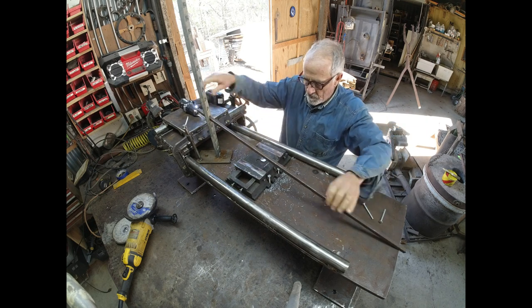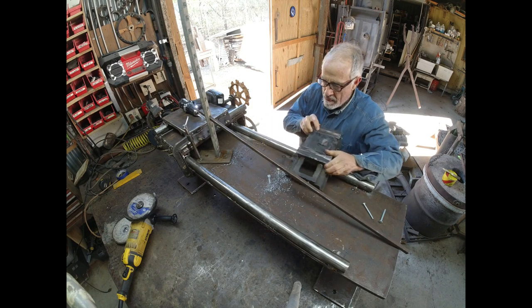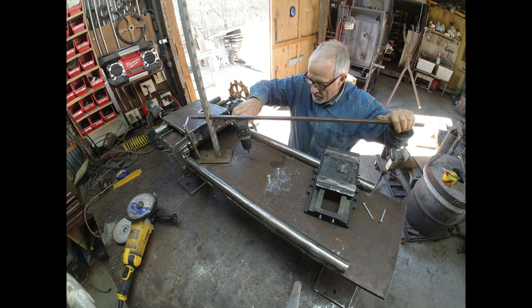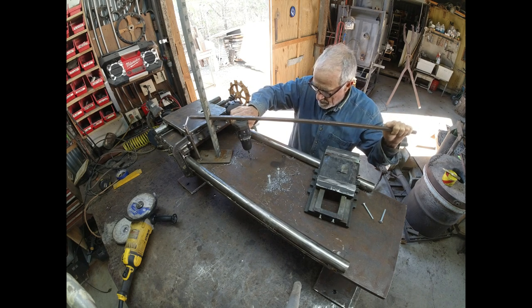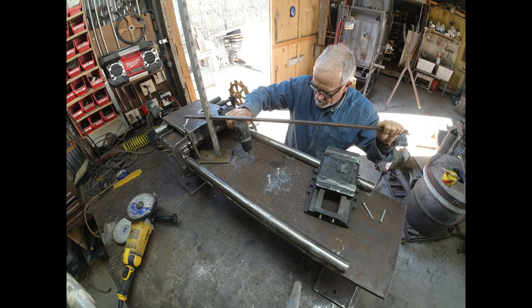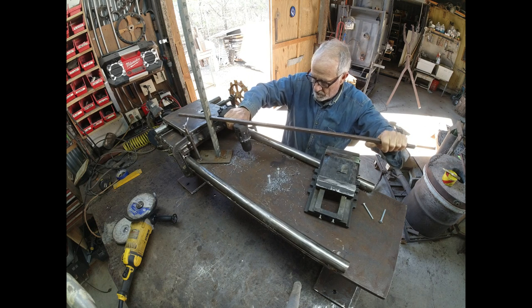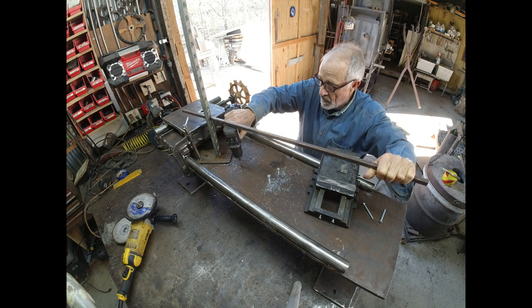Drill bits like a lot of pressure. They like a constant chip coming out. They dissipate their heat through the chip. And if you let the bit spin without a chip coming out, the heat builds up and your bit is toast usually. So you can't really push too hard, except on maybe little bitty twist bits. Sometimes they'll break if you push too hard. But most of them, they like a lot of pressure, and the holes go fast, and everybody's happy. The bits stay sharp for long periods of time.